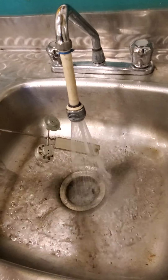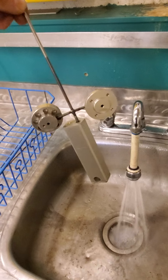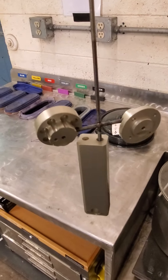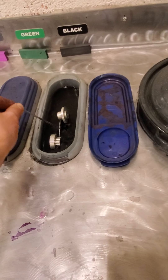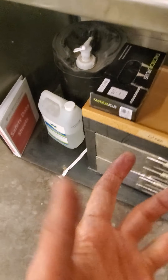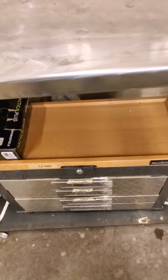I'm going to rinse these other parts off as well. If I wanted to dye them different colors I'd have to take them off the t-bar and put them on different hangers. These are going to be black, so I'd put on gloves, take them off by hand making sure the gloves are clean, and then put them on separate hangers before putting them in the dye.